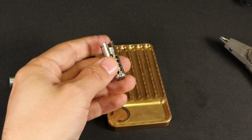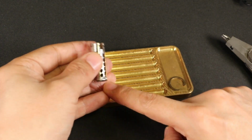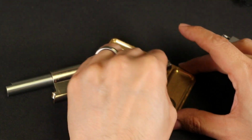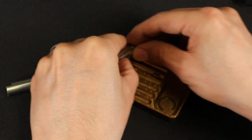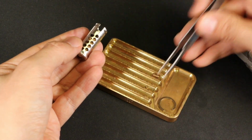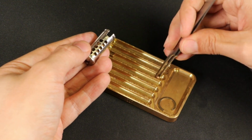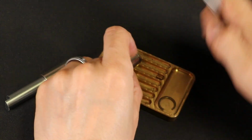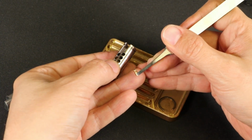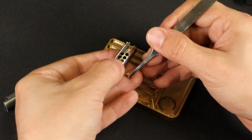So we'll go ahead and try to get these out. All right, I'll do it like this. Right side pins, left side pins. So 1, 2, 3, 4, 5. So right side number 5 right here. 4. And that wafer came out of number 1 right here. Right side 5, left side 5, right side 5, 4. And here's one of those pins that you could overset. 3, same thing. One of those pins you can overset.